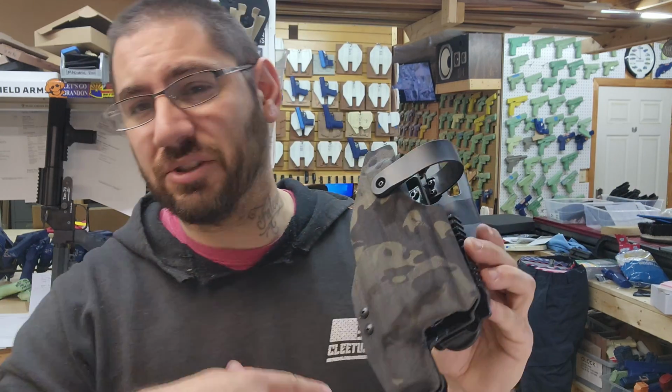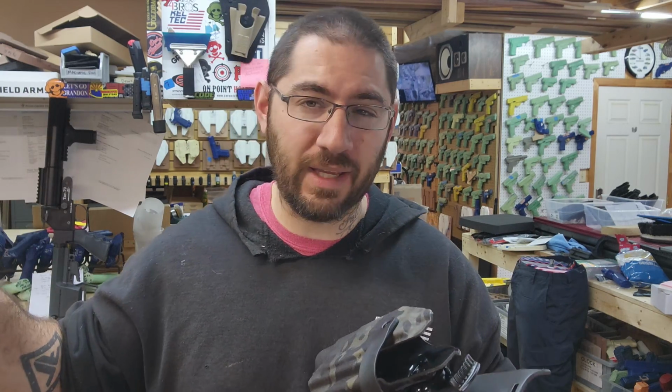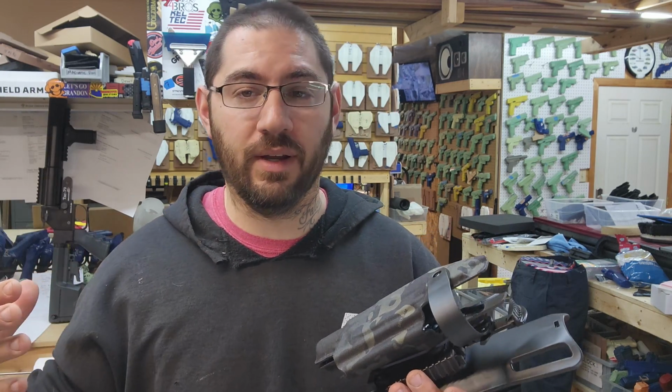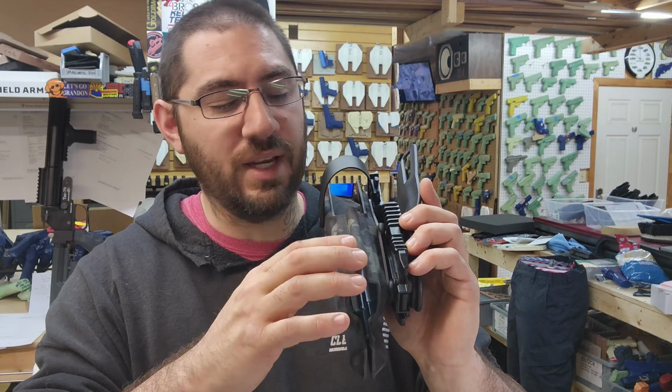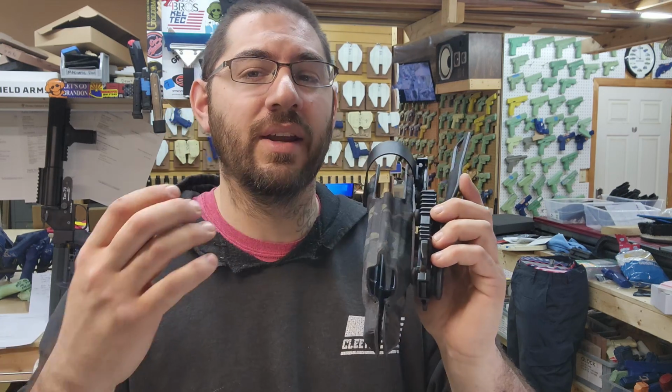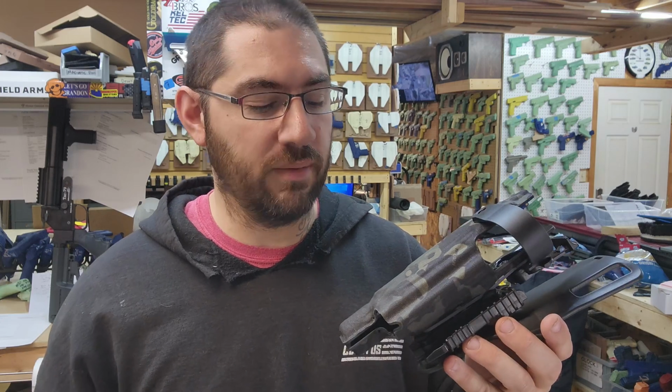All right, so it brought me back to the days of when I did a whole bunch of stuff. Now, like last year, you can actually get Cordura wrapped Kydex already. I haven't really perfected it on vacuum forming, but on foam pressing, I've pretty much vacuum formed because the foam pushes it in and it sticks in. It's so much better, but it doesn't stretch. So when you have the side channel, you really got to push it in on each side while it's warm, and then as the glue dries, it'll stiffen up on you.